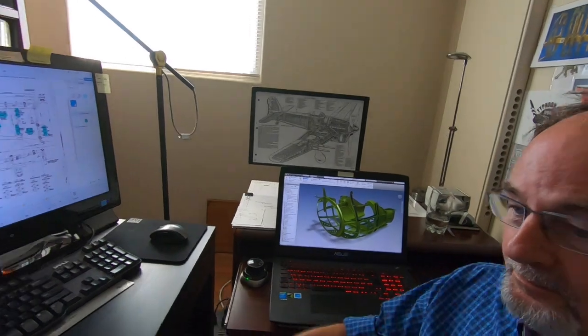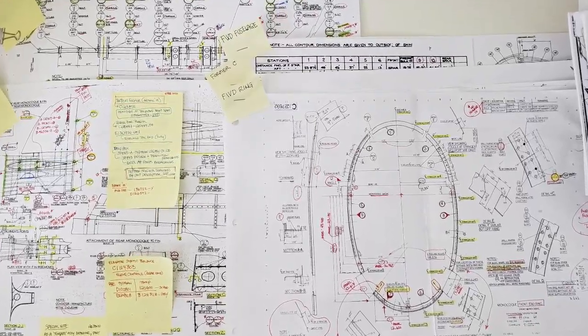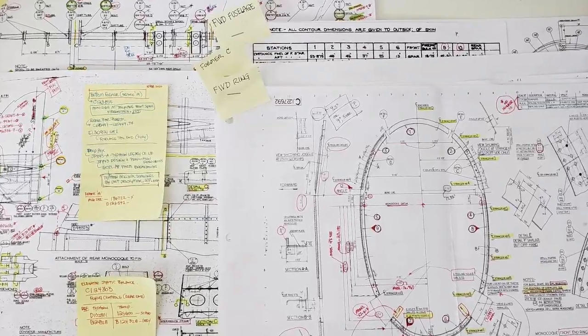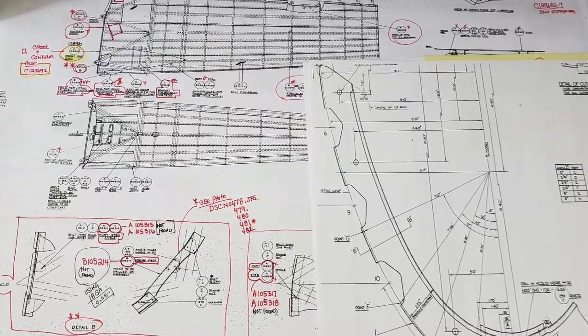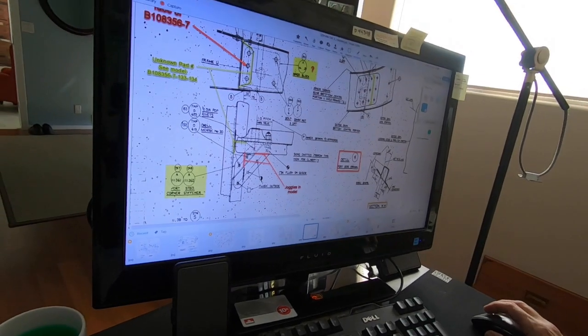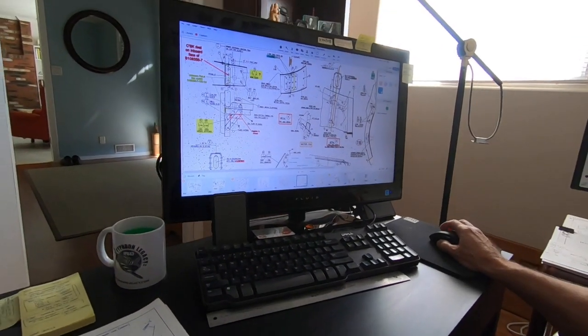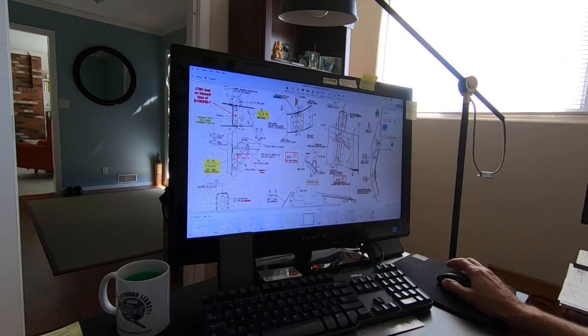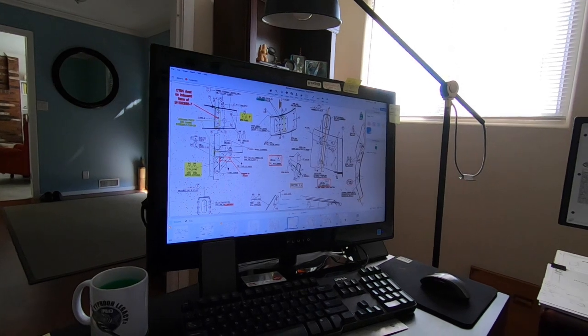So your technique for marking up drawings has also changed. With the forward monocoque and other assemblies, you started off with a paper copy of the original drawing. The paper copies were all marked up, drawn, indexed, and filed with the assembly — a method of tracking exactly what changes have been made, what's missing, what we have, and having that on file for certification of components. Over the time I've been on this project, we have been modernizing — no longer working with just paper markups and hard-copied printed original drawings, but now going fully electronic with all the markups and drafting notes.